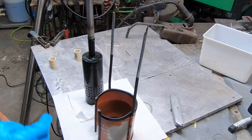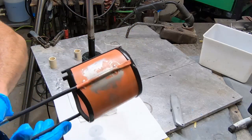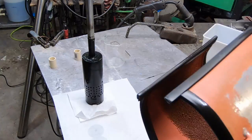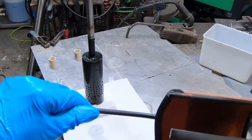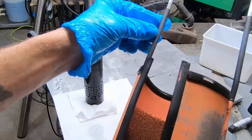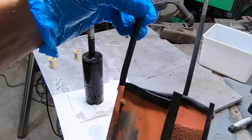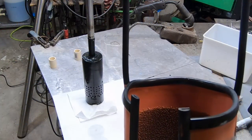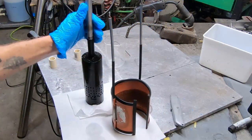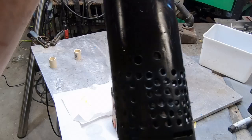So we did a 13-hour test there, and it would appear that the energy density is still too high. So I'm going to do another test — we're zeroing in on the energy density here. You can see we do have a nice clean deposit in there. We're going to lower the energy density by 50% because we're still getting preferential growth due to the holes in the basket here, which did very well. I'm excited to weigh this thing, so let's bust it apart and tally up what happened.